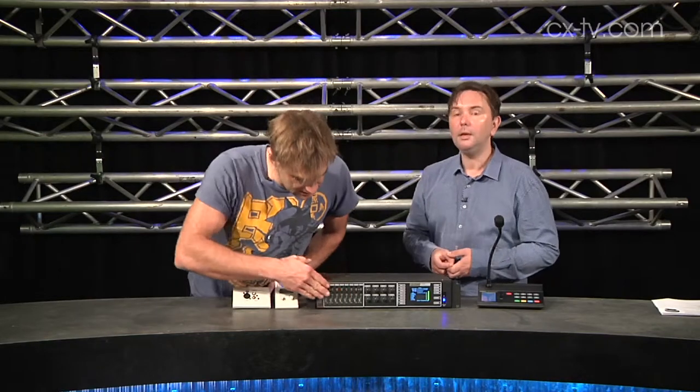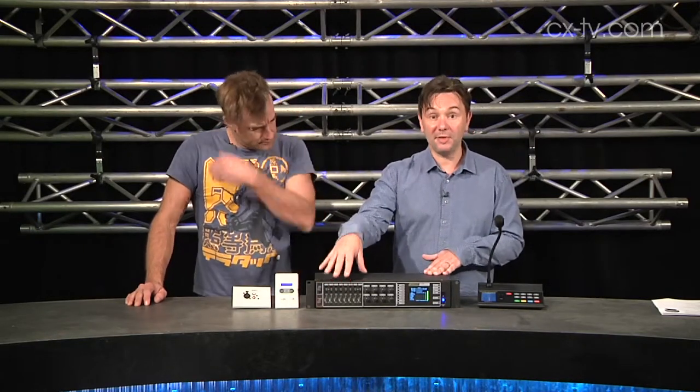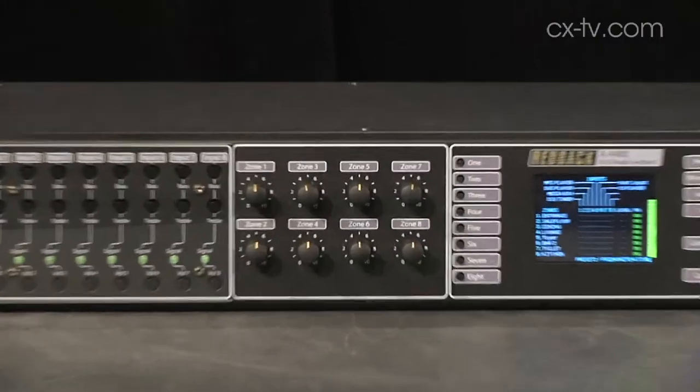I like that there's a little plate there, so once you've set all your input trims and bass and treble settings for your individual sources, you pop that plate on and no one can adjust those. With some of the front panel lockout, there's old-school perspex plate physical lockout, and digital lockout over the presets. However, the eight zone master analog pots on the front apparently can't be locked out, which is a bit of an odd thing, but people shouldn't be playing with it anyway.